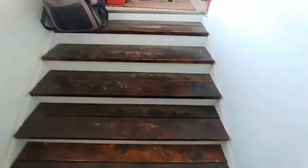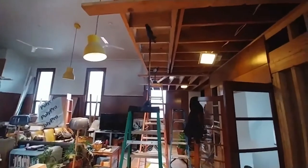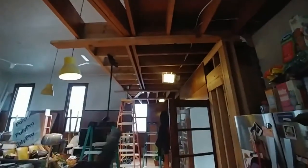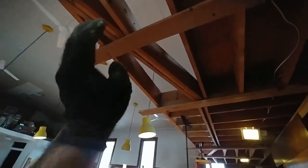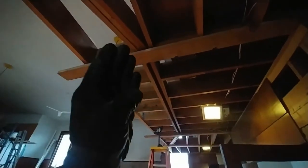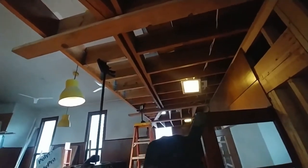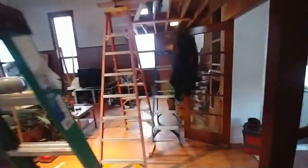Now we'll do another update on the balcony project. Okay, sometimes you've got to do what you've got to do. We had these outermost scab blocks, this 2x6 at the far ends, to sit this LVL down onto positively for safety's sake when we first installed it, so I left those. But I moved a few in here to get underneath the ends of the first full width of this thing, considering that it's growing in width all the way up from behind us, as well as being right along the pair of joists there and pair of joists at the other end of this entryway that are essentially beams. I screwed up into those, and I'm out underneath this now, as well as having these step ladders with clamps on them, which is where I started and continued from there.